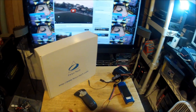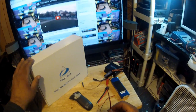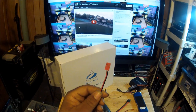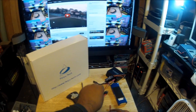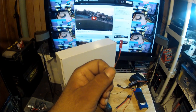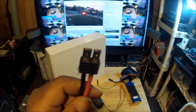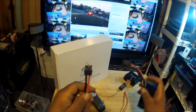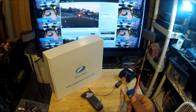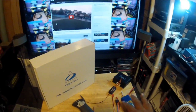These wires here are what I'll need to adapt to the aircraft's wiring harness. The first one is a Futaba J cable that's going to power the receiver connected to the main wiring harness. The next one is a JST connector that's going to power the FPV transmitter from the main battery. And this Traxxas connector is what I'll use to power the aircraft from the battery - I use Traxxas connectors on all my batteries just like my RC cars. The aircraft comes with Dean's from the factory, so I won't be using that.